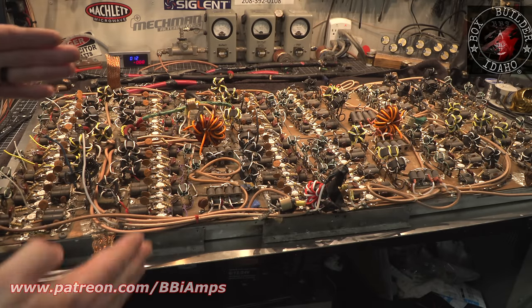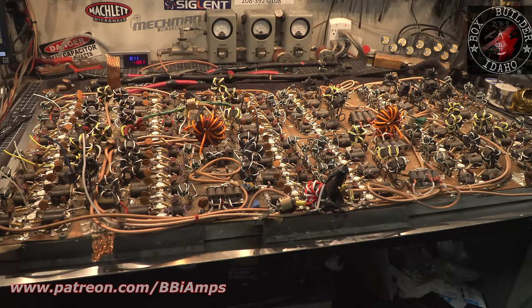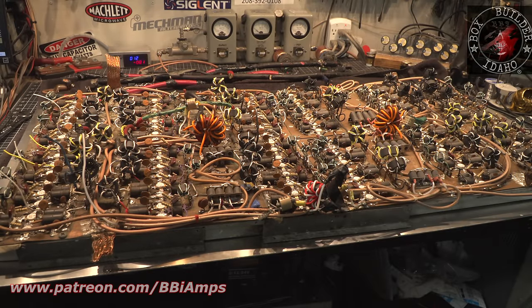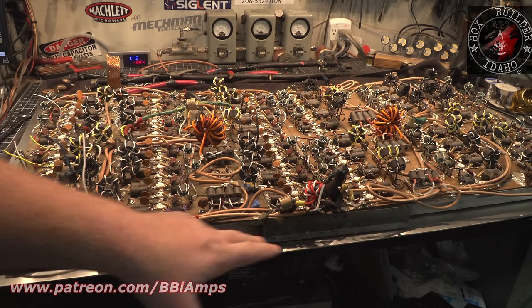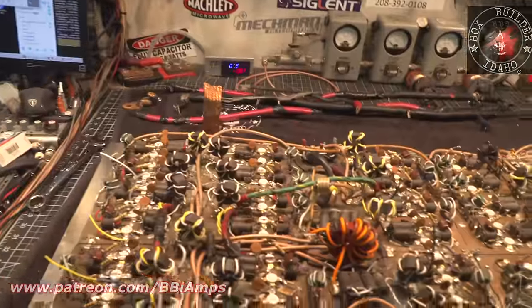You start to run into an Xmax of how much current can I really shove through this wire? The more we can shorten the distances here, the better things are going to run. The shorter the power wire, the shorter the ground, all of those distances. So in an ideal world, we'd have a couple bolts that hung on the back of the cabinet, and that's where all the ground current would flow from. Because remember, the electrons flow from ground to hot, in a big circle. These little tiny brackets weren't enough, hence the reason why they were having such a hard time.